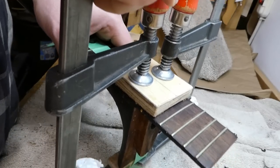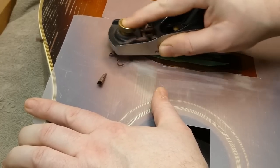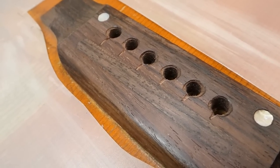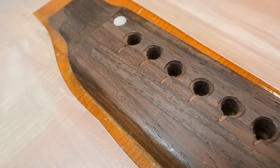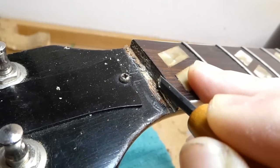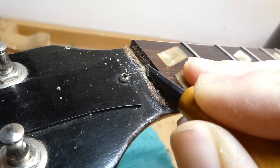I'll press that in place with the ruler while it's drying, then use a combination of super glue on the shim and fish glue on the neck itself to hold it accurately in position while I get the clamps on. The clamping caul has strips of cork along each of its outside edges. The saddle plug in the SJ is dried enough that I can now plane it down and sand it — I think that's a reasonable looking plug; you're not going to notice that too much.